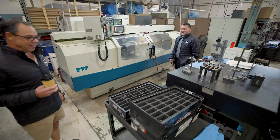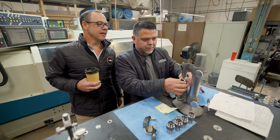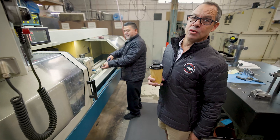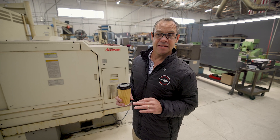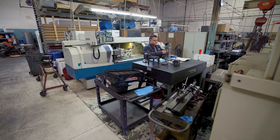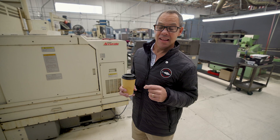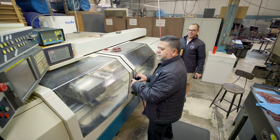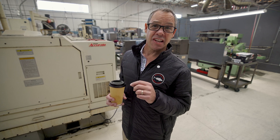This is Juan. He's one of our grinding and lathe guys. What tolerance are you holding on this? He checks every part — he moves at 20 millionths, which is 0.000020. On that type of job it's critical for aerospace. There's a lot of grinding going on in aerospace, mainly because the tolerances are so tight. If you really want to hold a really tight tolerance consistently, you've got to use a grinding machine, and that's what he's doing. These guys are very specialized — that gentleman's probably got 30 years of experience. Just one little mess up or he's not paying attention and you're throwing thousand-dollar parts in the trash pretty quick.